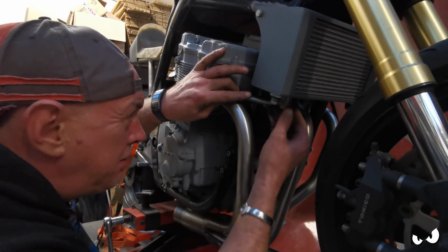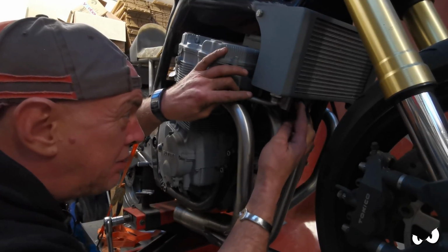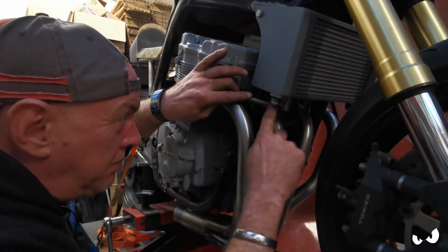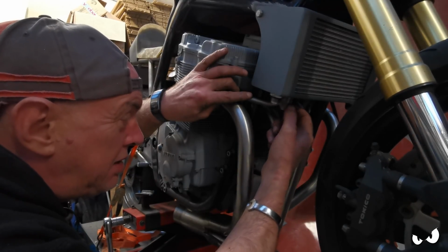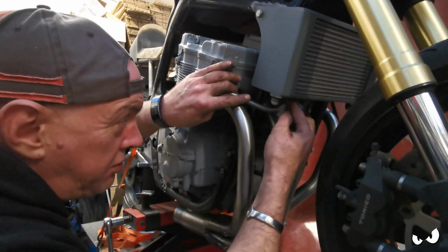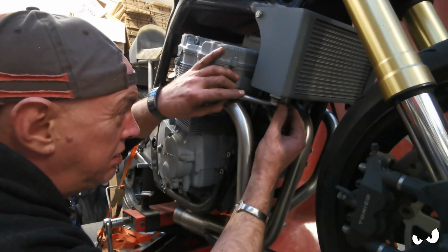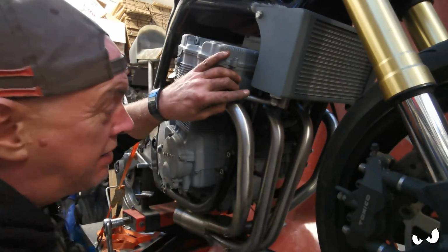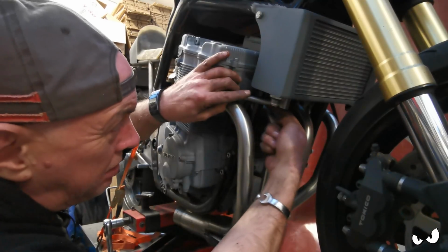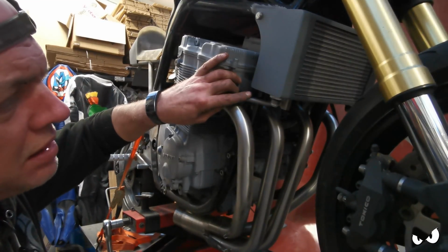So it will stand down. We'll have the plug that I'm obviously going to be making to go on the bottom here. That'll be plug welded on from the back. So we're just going to have a little shoulder that comes out to the same width as this. Then there'll be a rubber which will go into this as well. The screw thread will carry on down all the way through another rubber on the bottom, then a washer, and then just a domed nut on the back of it so you can't see the thread. But essentially it's going to look like that. It's just that this bit will obviously be on the inside of the frame tube. I think that'll look all right.